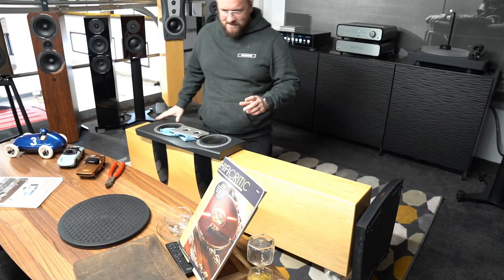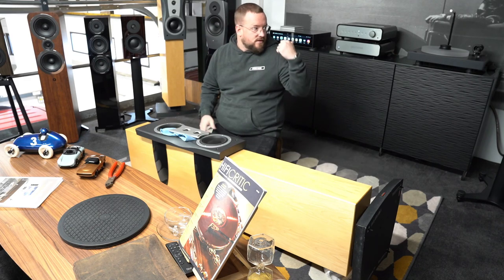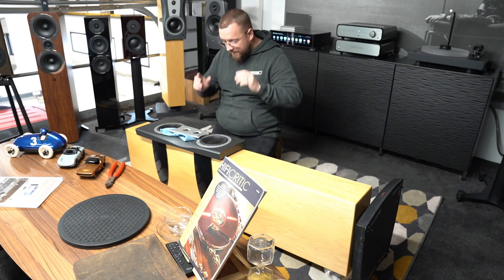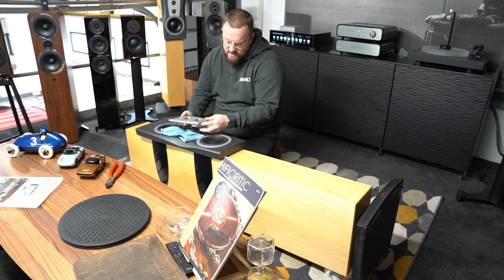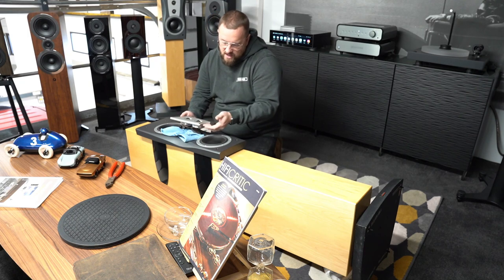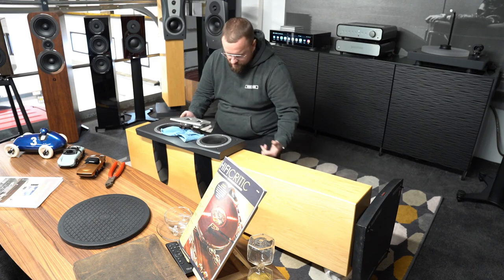So for you guys it's been a split second; for me it's been three days. I've got time lapse of me taking this apart, but I had to stop because I had to deal with something, and then the next day was very busy and then the Confidence Twenties turned up — but this is still in the same position it was when I had to leave the video. I've taken the drivers out and had to take the drivers out to release the tweeter unit, the fascia or baffle for the tweeters. This is an interference fit — the bolts for the mid-bases clamp this down with a gasket that passes in front and behind to keep the cabinet sealed from the front, because there's a whopping port on the back.